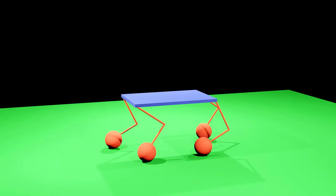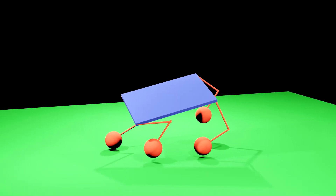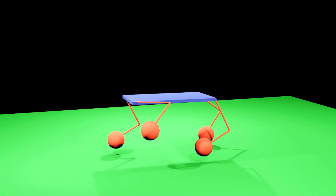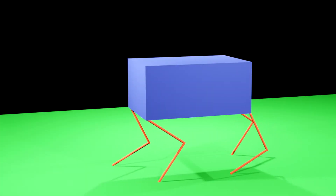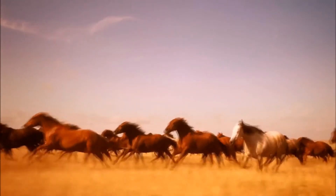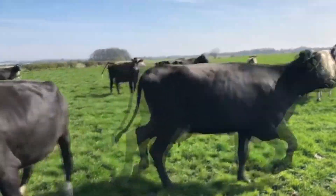Why? This has to do with inertia. Imagine a robot that is heavier near the feet — the inertia of the foot could be very large, causing higher resistance against motion when the feet are lifted. This will cause the torso to fall down and unbalance the robot. So we want most of the mass concentrated in the torso. This is also true for large quadruped animals, which have very light legs and most of their weight in the torso — that's why lifting their legs does not unbalance them.